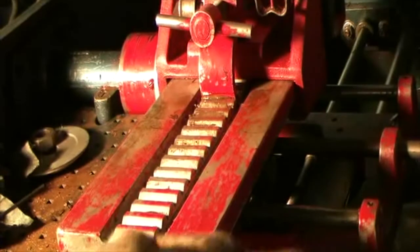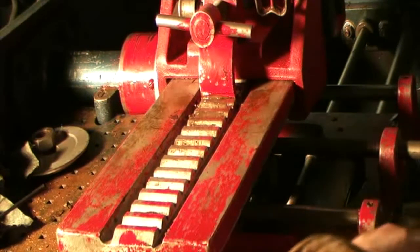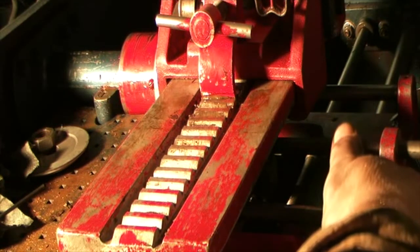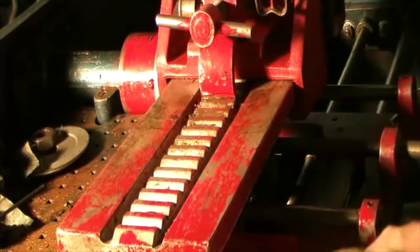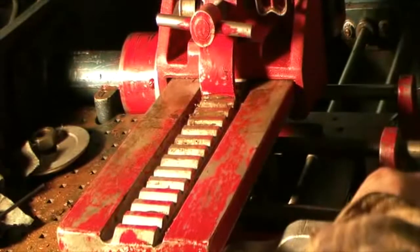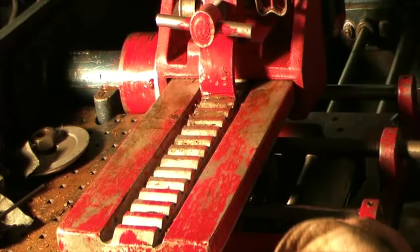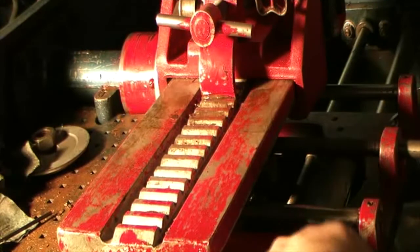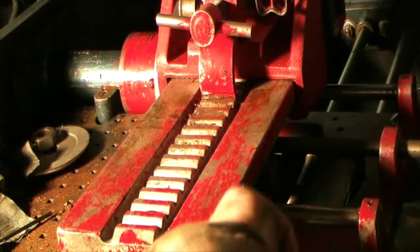So there's some stops hidden here, and I would suggest going to the Highland Park HPLapidary.com and look for their Frantom videos, and they'll show you exactly how to line those up. Unfortunately, with what I had going on here, I've got to line these up while they're on the saw. I don't have the luxury of doing it off the saw. So I open up the jaws, get them placed centered. Loosen up the bolt a little bit. It holds the stop.